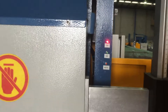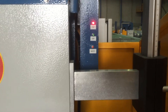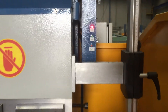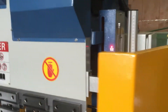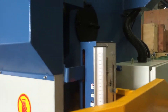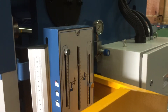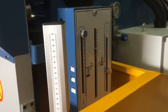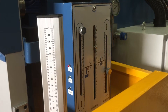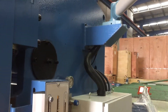We've got a new indicator that shows the position of your guard — top, DSP, and mute — so it's easy for the operator to actually see where the guard is. To change your open position and bending speed, that's located on the right-hand side of the machine, so it's very accessible and easy for the operator to set the open height and change the changeover speed from fast to slow. The arm gets moved to the front of the machine once it's on site.